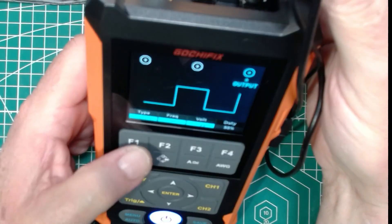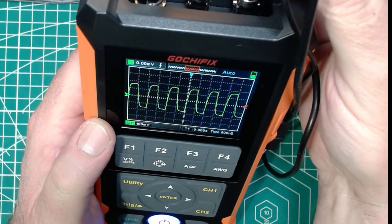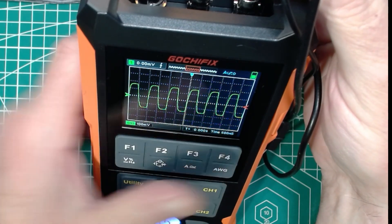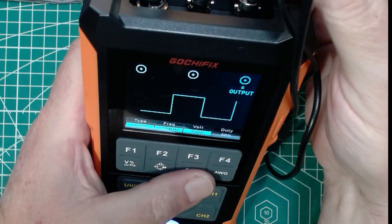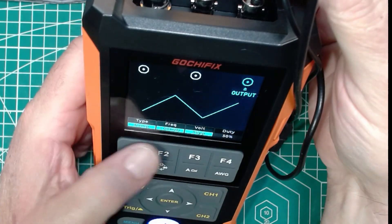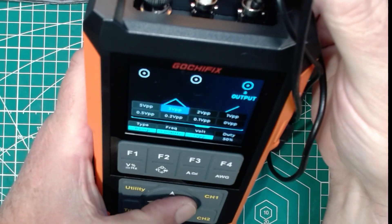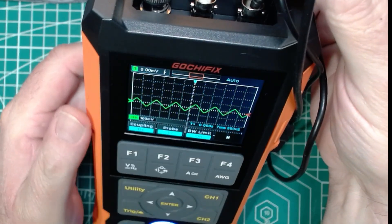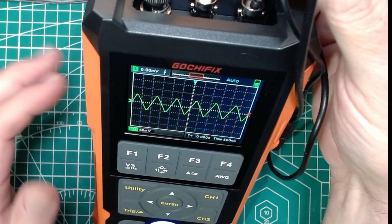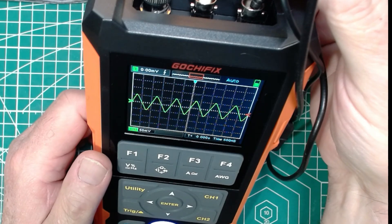Let's change our waveform type. We're on a sine wave — let's change to a square wave. As you can see, it's not a pure square wave; it's a little sketchy looking, probably a function of the frequency output of the waveform generator. Keep in mind we're doing all of this on the same device. Let's change our type to a ramp, and that looks about exactly like I'd expect. Ramp, sine, and square are the only three waveforms it puts out. Let's change our peak-to-peak voltage to 1 volt — back to our scope, and it did change our output size. We can hit auto again and it adjusts the scale for a more pleasing reading.